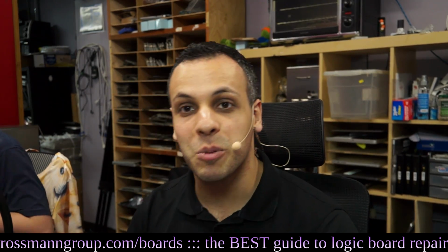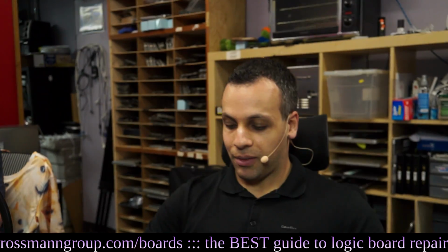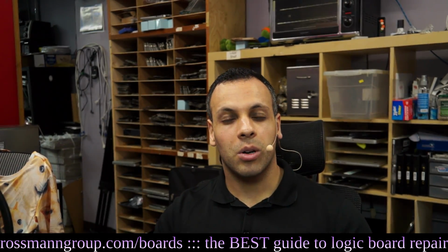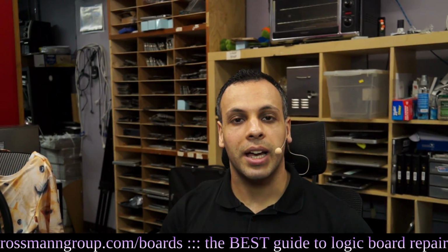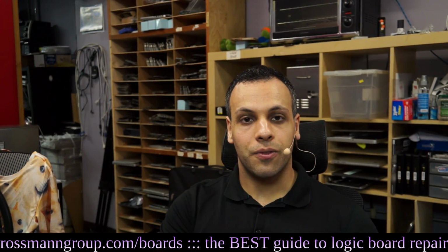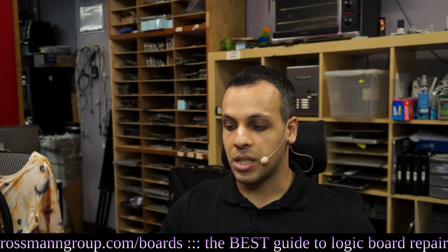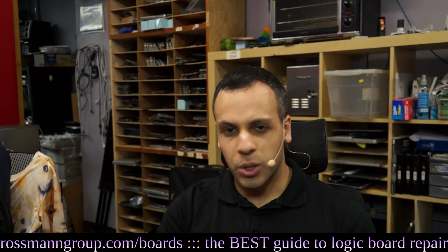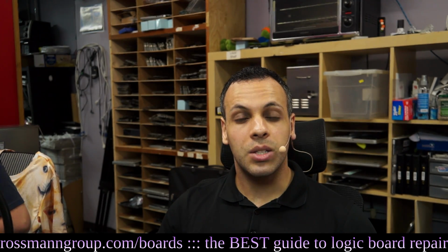Today we have a touch bar that's running ridiculously slow. The first issue is typically a sensor issue. Now, we used to be able to run something called the Apple Service Diagnostic. The Apple Service Diagnostic would tell us which sensor failed. As a result, we would be able to go into the board and figure out which components we needed to replace. That is all but gone.